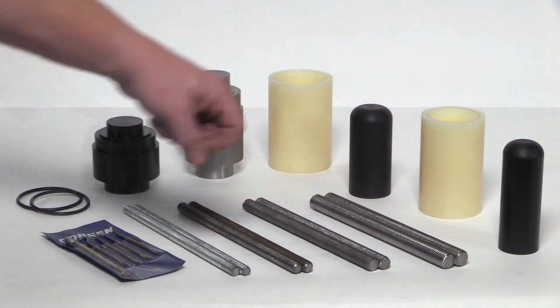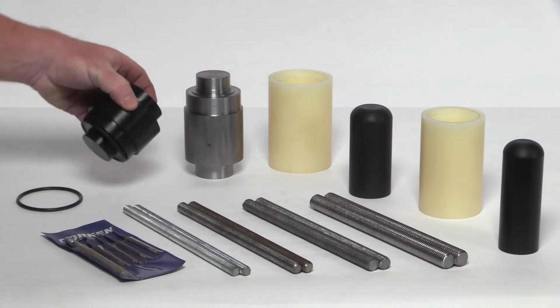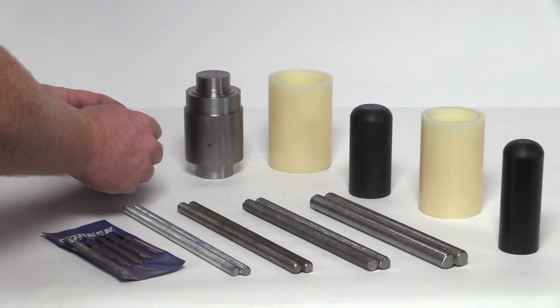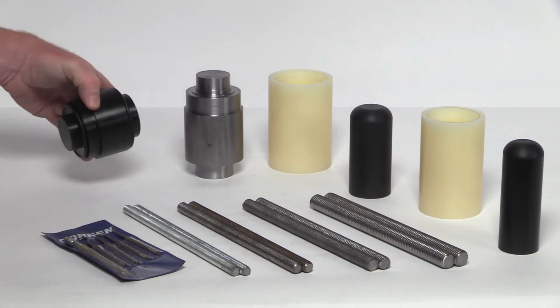A seal seat installation tool with shouldered O-ring holder. This is a two-sided plastic tool used for hand press only. The small side is used for all pumps except the Z4200 and Z4500. Both of these models use the large side.